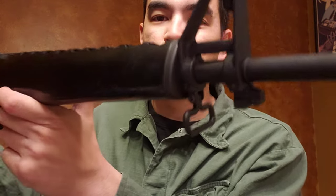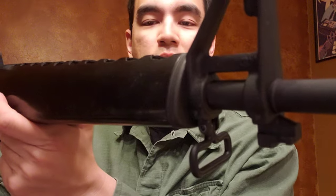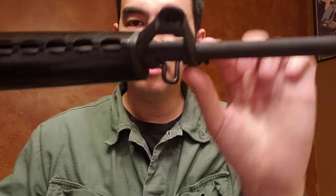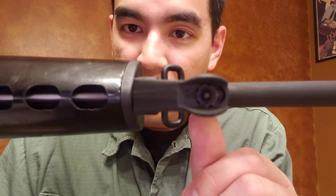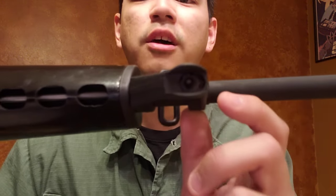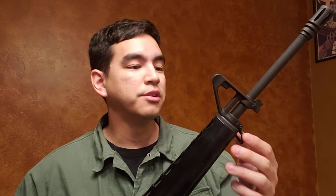For the front end, there's a triangle end cap, which is correct for the A1 — though some A2s, A3s, and A4s also use a triangle end cap. There are also round end caps. The front sight is actually a little different from your A2s and A4s — it's a five-position front sight. It's kind of hard to see, but there are definitely five notches in there versus the other style which has four. That's why AR front sight adjustment tools have one side with four notches and the other with five — that's the A1 style.